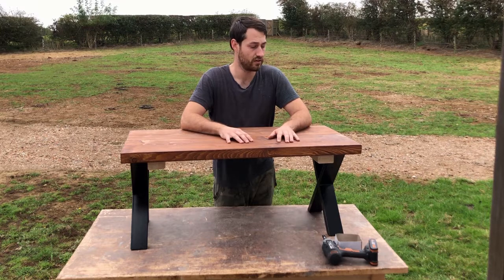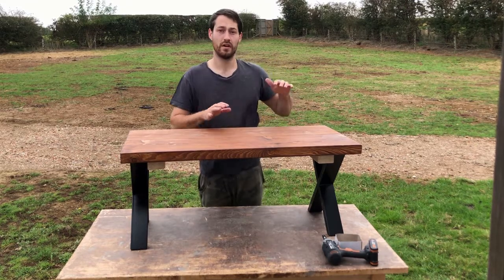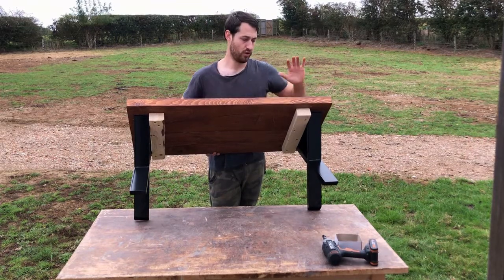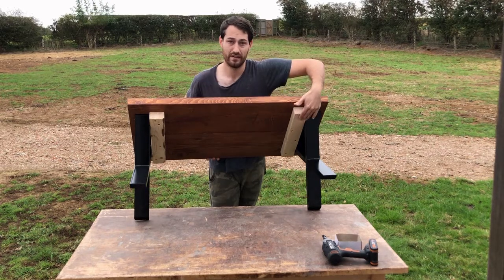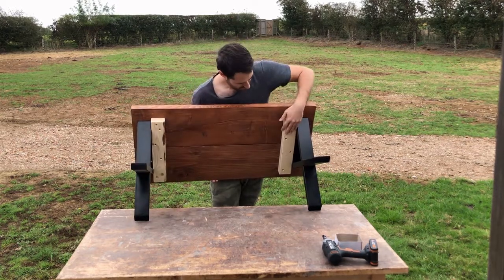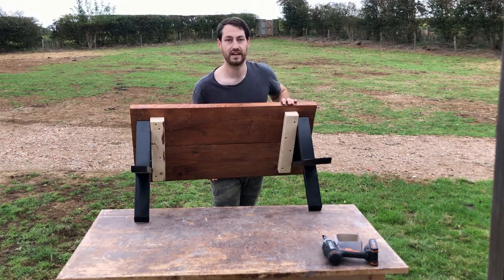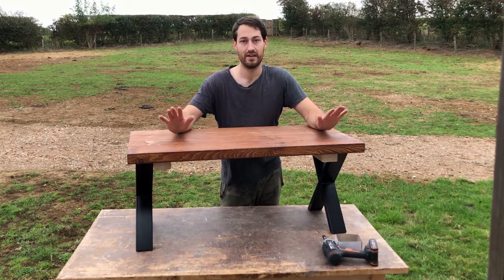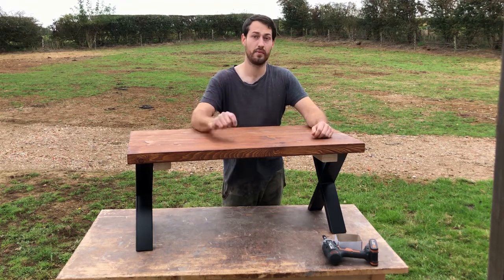You can very easily build your own matching dining table to this design. All you need to do is cut a few more pieces of wood to a longer depth and have your supporting pieces just a bit longer so they support three or four lengths of wood. Of course you can stain these supporting pieces of wood to match the color — I haven't done that on this occasion, but it would be really nice if they're all matching, then you won't see the white sticking out from underneath. Here's the basic design to build your own X-leg bench. Hope you enjoyed watching — please join us in the next video and subscribe if you enjoyed the video.